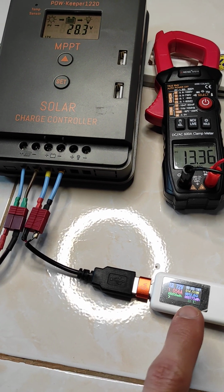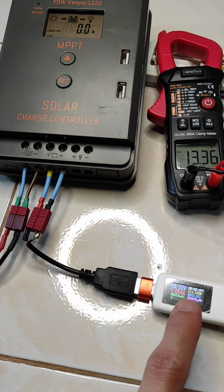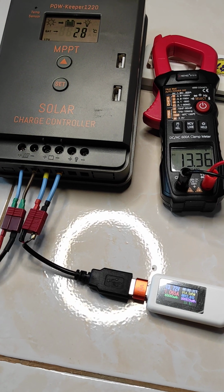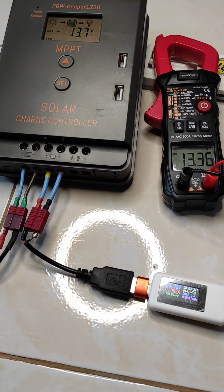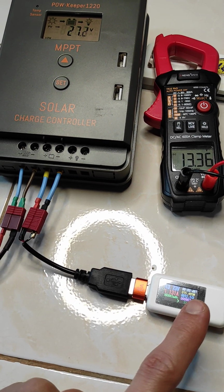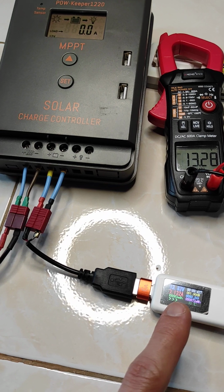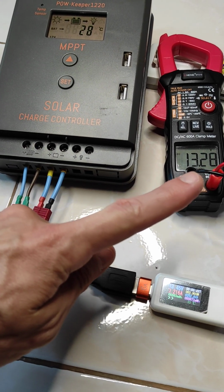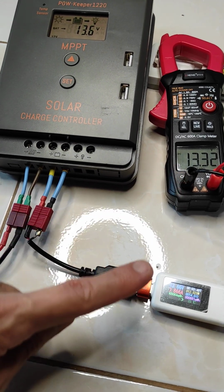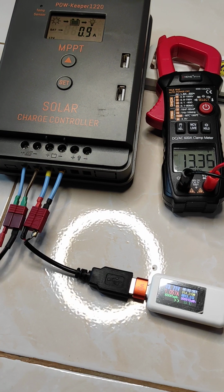So now we are close, around 340, 350 usually, 4 minutes it will drop. 340 I have seen before, I have run that test already a few times. So there you see it, it goes down to 0, that was like 340 something. And here you see also the battery voltage was dropping, 28, and soon it will rise again and start again to charge. Okay, here we go. It rises again to 1 amp, or like this 15-16 watts.